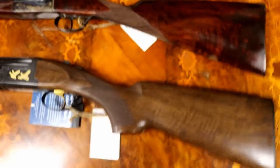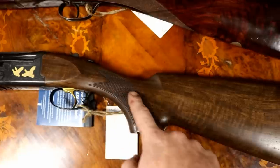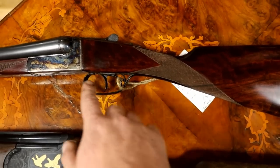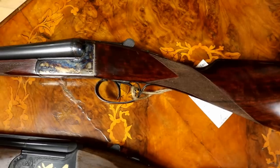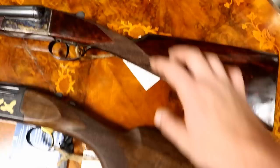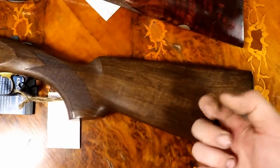This is because the over-and-under is held on with a stock bolt that comes all the way from the back to about here, where it's bolted on. The side-by-side, generally speaking, is held on by the action with some pins that actually come through the actual head of the stock there and hold it all together. As such, you end up with a much stronger piece of timber at the back than perhaps you would here; however, nobody ever broke one of these stocks. It's just a bit hollow by comparison to that.